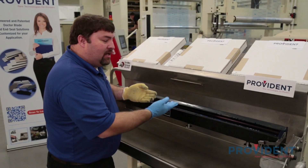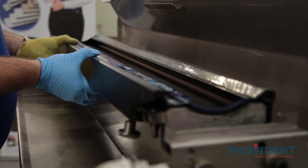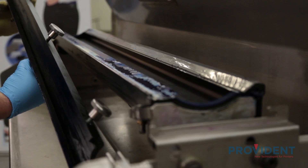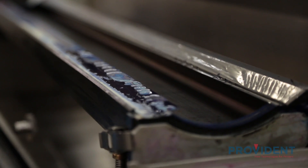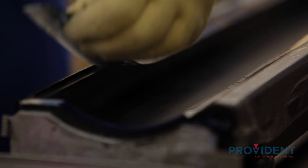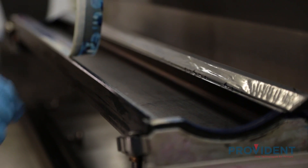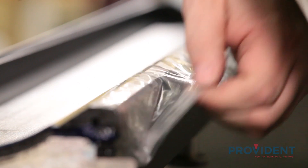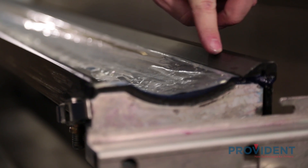What we want to demonstrate is how easy chamber wrap makes it to clean up the process. I'm first going to remove my containment blade system that does not have the chamber wrap. The top side of the doctor blade and holder has leaked, which will require cleaning. However, the underside has the foam seal, which prevented anything from getting inside the blade holder. We're now going to take out the chamber wrap system. Unlike the containment blade, the metering blade with the chamber wrap system does not need to be cleaned.